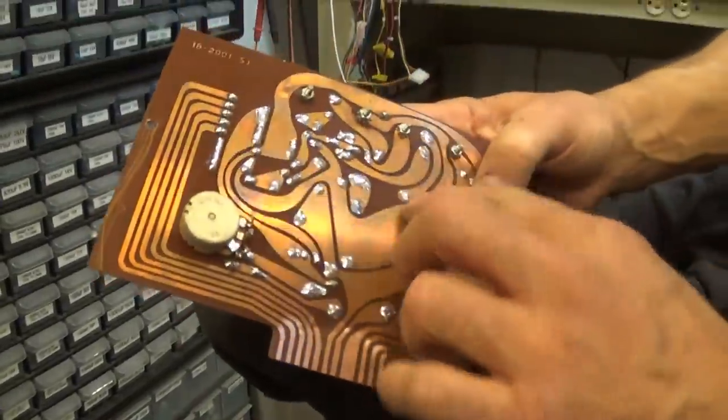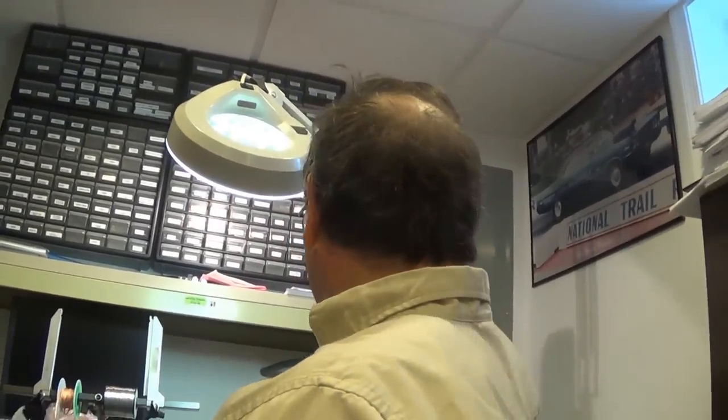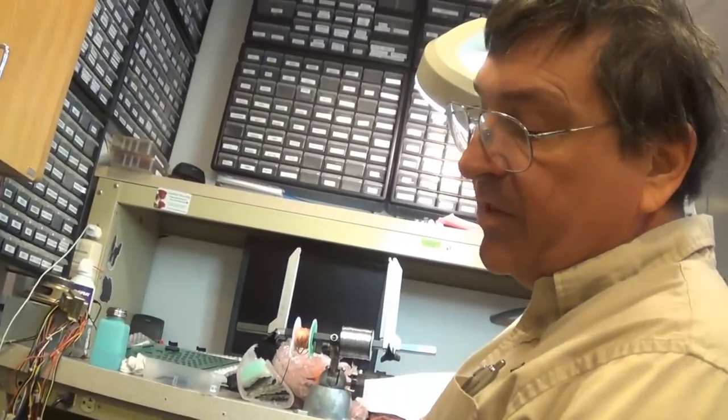Then you want to go over your solder joints, some of the big ones. Remove old solder. If you have a desoldering station, use it. I think we actually covered this in It's All Crap. You were there. Remember? So you don't just hit it with a solder pencil and build up new. You don't just leave what's here and pile new on, because underneath that it'll still do this, only you won't be able to see it. That'll really be tricky. You remove it, put new on.